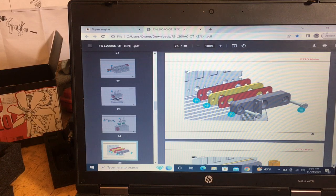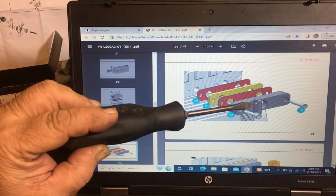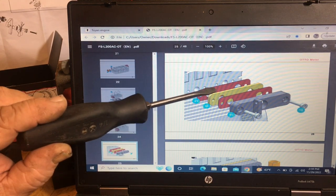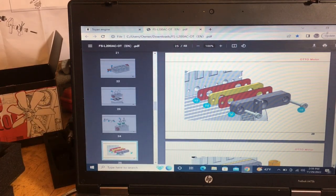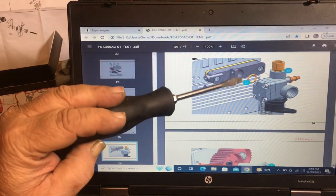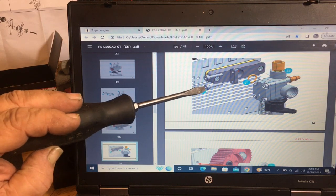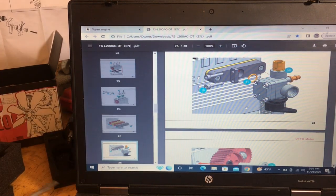This is where that thing, I didn't know what it was. It's an intake manifold, and it has a boss on here to screw into the carburetor. So we have two number 18s. You've got a number 50, a 48, and a 49. These are your gaskets that sandwich all together so you can put your carburetor on there. Now that's done. You'll see there's a number 21 that goes over the shaft of the carburetor to seal this off here. These number 18s, two of these mount through these holes here and bolt the carburetor right to the intake manifold.